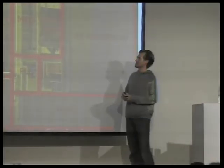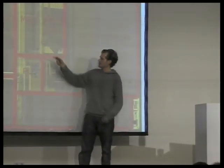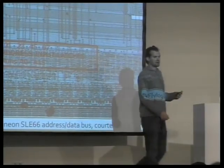How do we break this? Well, easy. If it's decrypted here before it goes in here, we wiretap little wires in between here. And these are exactly these wires. We use tiny needles, poke in there, and we see the bits flowing by.